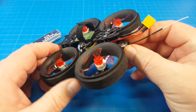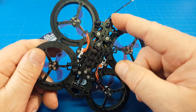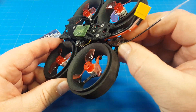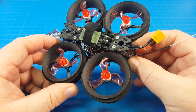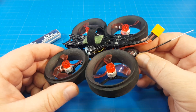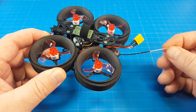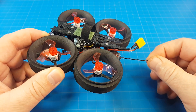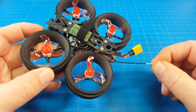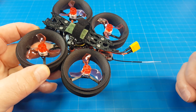There is a bracket inside made of the same material as the hoops that mounts the VTX, so it is secured — not just foam taped down. The receiver is the AC900, which supports Futaba as well as FrSky and the EU FrSky protocol. It is foam taped and stuck down, though it seems to hold pretty well. I'm a micro guy so I can't report on long range, but I found the range on this receiver works better than a typical XM FrSky receiver on other quads.